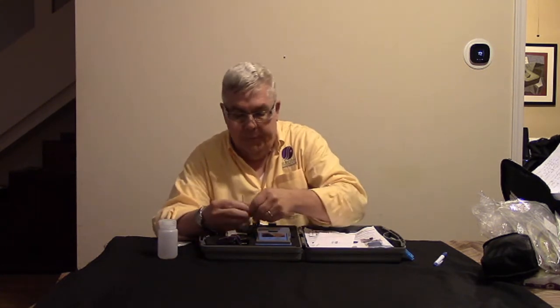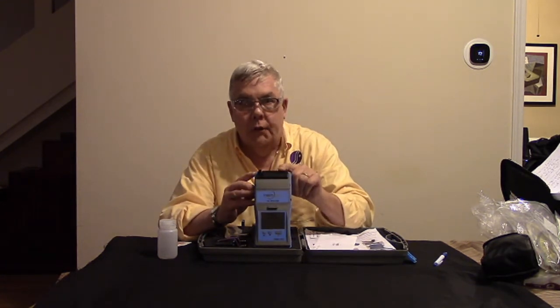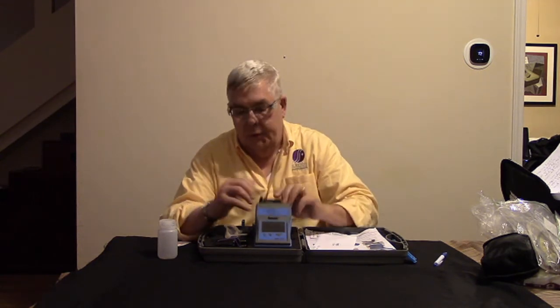And we also have some heat shrinks, which you're going to need. A heat shrink's got a little metal rod in it. There's an oven in the splicer, and the oven is going to cook the splice when we put the heat shrink over it, and provides protection for the splice after it's done.